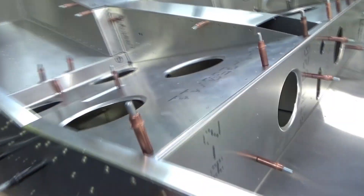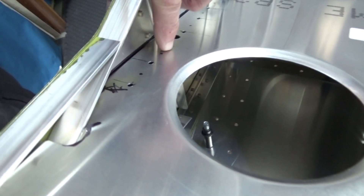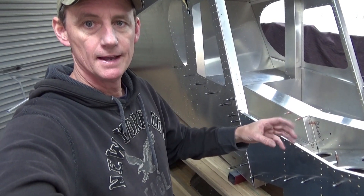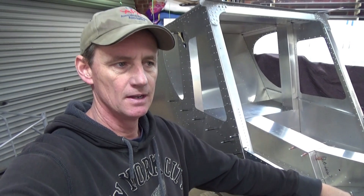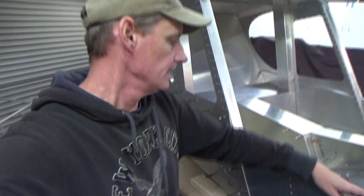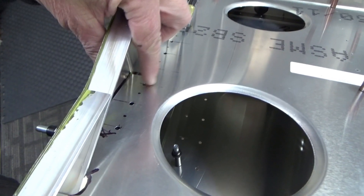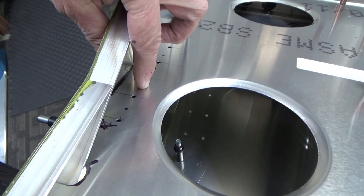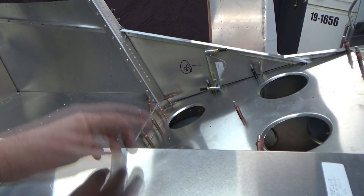I did have one issue — I was waiting to join the fuselage all as one piece, but I drilled the seat pan along here while the forward fuselage was separate, so the fuselage was actually wider than it needed to be. I think the technical term is I've balled that one up. It's not a biggie though — I can drill out the holes. They're about 3mm from the hole that's underneath where it was drilled through. I can put another rivet every second rivet if I need to. Also the seatbelt brackets — haven't riveted those yet, because when this comes off I'll be able to drill in from the back without the rear fuselage in the way.